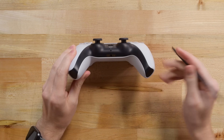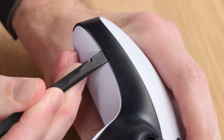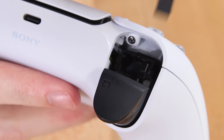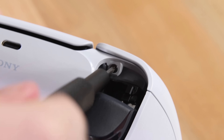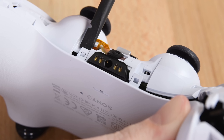The minimalist design means there are no visible screws, but you can pry up this black plastic cover around the joysticks — a little spudgering does the trick very nicely. That reveals the first two screws, with two more hidden under the L1 and R1 buttons. Maybe don't try this near any open windows. Now we can dispatch the four Phillips screws — take notes Nintendo, no tiny tri-points here — and open this thing up.